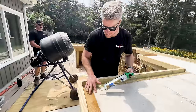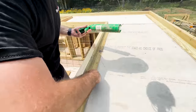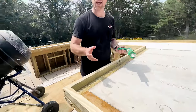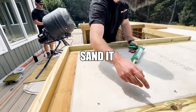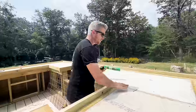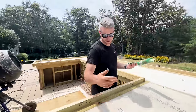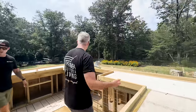Just filling all of our voids with some silicone. Went around all the edges so that all the edges, hopefully when we deform this, are nice and uniform. We're still probably going to sand it, buff it, grind it, finish it a little bit. We don't want any concrete falling through here, so that's why I'm siliconing any of the gaps. We're almost ready to pour.